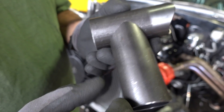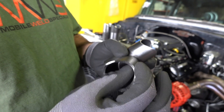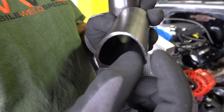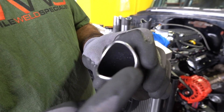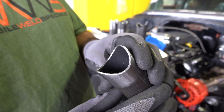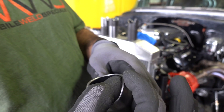If you start welding that around, you're not welding at your 090, 095 wall thickness or whatever is required. You're actually welding on this paper-thin portion. So what we do is we grind that back - sand it, grind it, flap wheel, whatever you have available. So then all the way around, it's back to the full wall thickness.